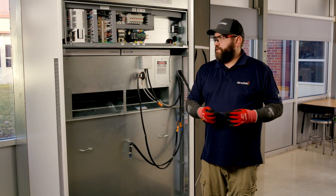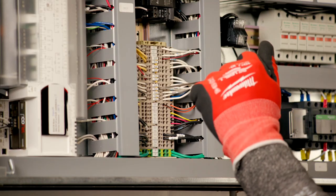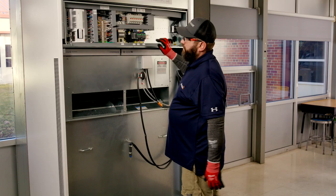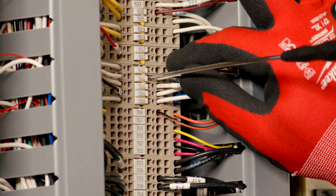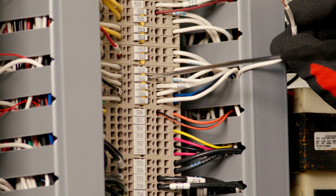When I place the terminal screwdriver within the square of the terminal block and jab it in place, I can let go of the screwdriver — the jaws are open, holding the wire. I can then grab hold of the wire and pull it out of the terminal block.